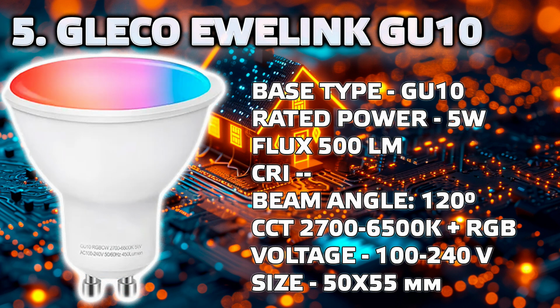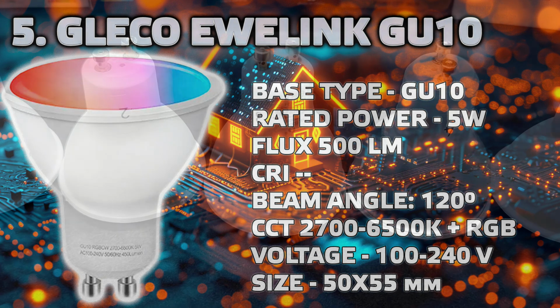The fifth participant in the testing has the highest declared light flux of 500 lumens. The color rendering index is unknown, but likely at least 80, with a 120-degree light beam angle. It resembles the first and second bulbs in appearance, but is slightly more compact with a convex diffuser.